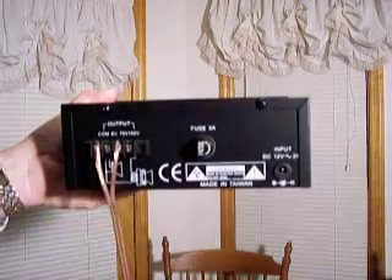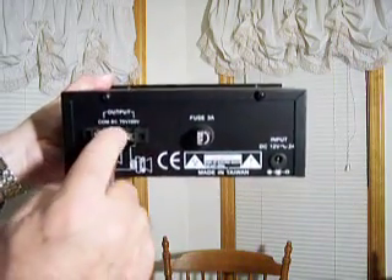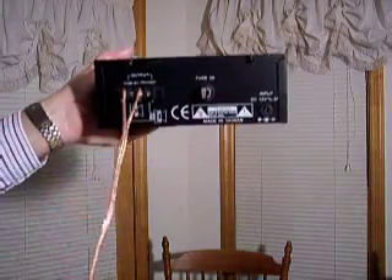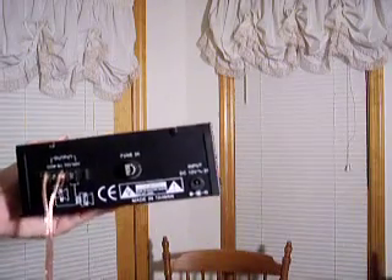In most cases, our speakers utilize 70-volt transformers, so you would tap the 70-volt line. You only have two conductors — common and 70 volt — and these two conductors go right out to the first speaker. Another piece of good news with a 70-volt signal is you don't have to come back to the amplifier with every speaker wire. You can just daisy chain right on to all the speakers, and the last speaker in the line is the end of the line. You don't have to come back to the amp, which really does simplify the wiring process.